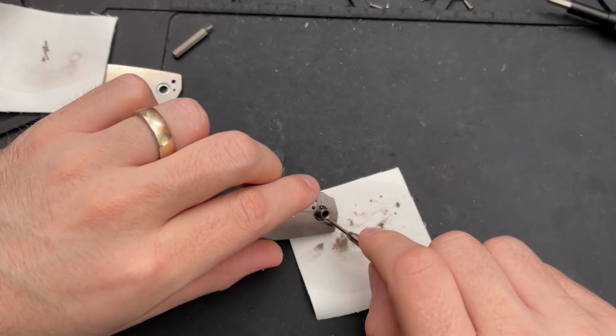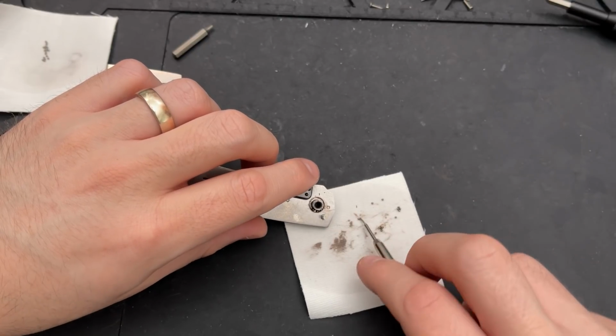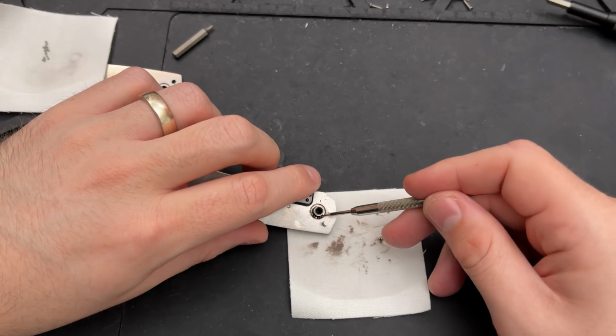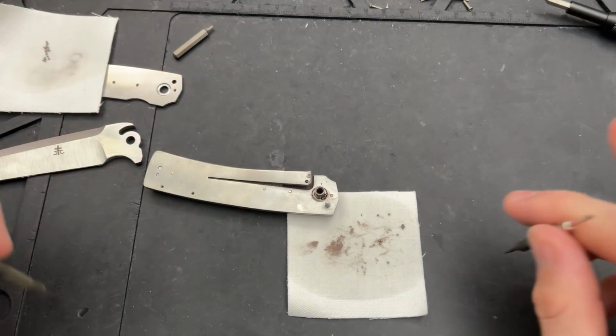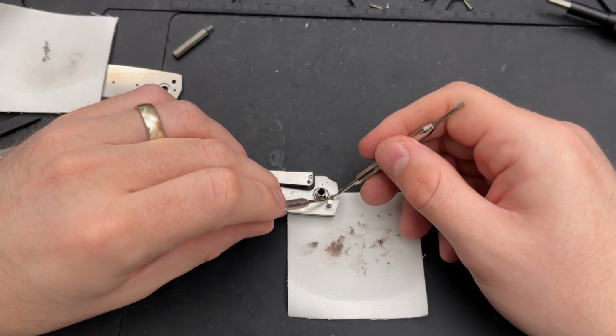The bearings are very small, so it lets you make the knife very thin, relatively speaking. At this point, I am just targetedly getting in there and picking these guys up using their own grease, basically. Another approach I can do is to grab another spring bar tool here and kind of not quite chopstick them up, but pick them up in that way.